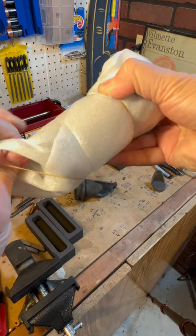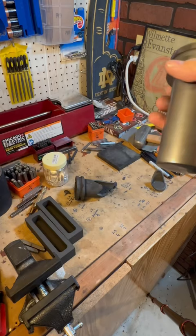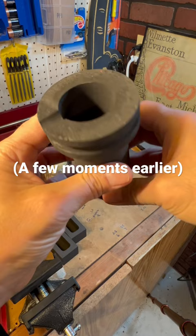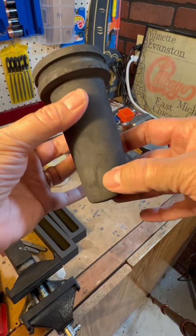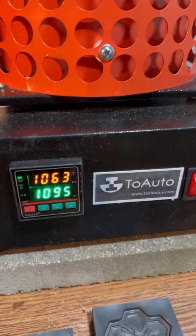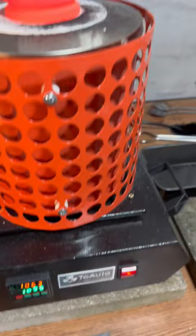Take a look, you can see the difference between the old and the new. Once you've used your crucible enough times that it's kind of worn out — as you can see here, this one has melted on the side and it looks like it's pretty much reached the end of its lifespan. Then it's time, when you don't have any confidence left in it — you sure don't want a catastrophic meltdown in your furnace — it's time to get rid of it.